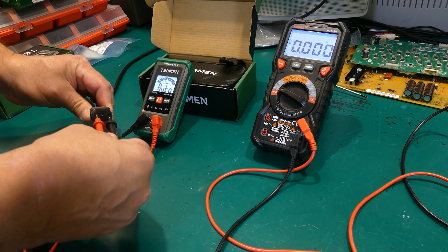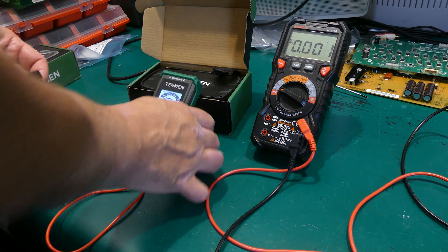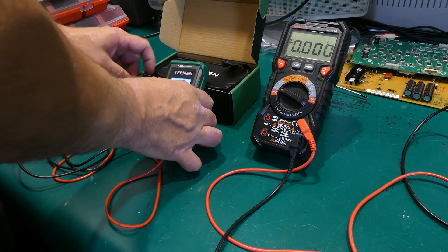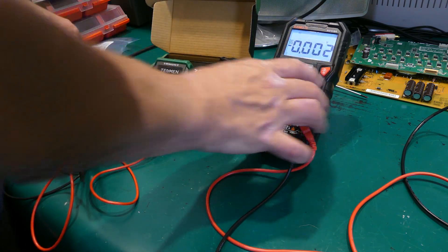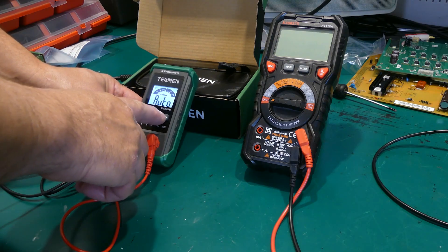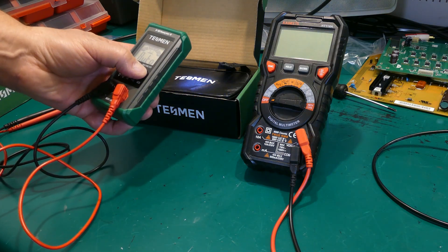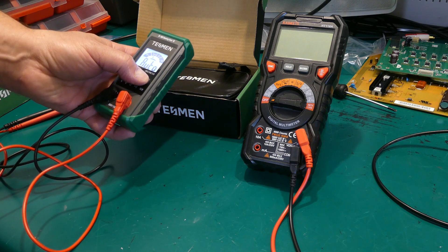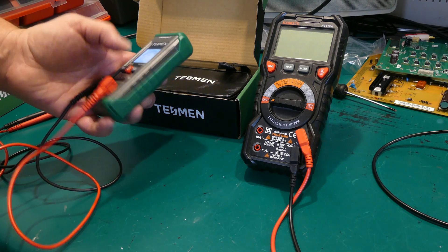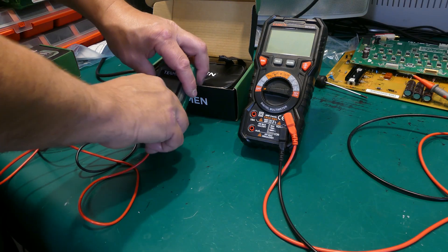The meter has a little backlight for the display that you can set on or off and it stays on — a great bonus when working in the dark, and even with big lights it displays clearly. It might even be a little brighter than my large meter. Turning the light on is easy: simply push the light button on or off. If you hold it for two seconds, it will turn on the LED at the back of the unit. You can light both at the same time by lighting the backlight first, then press and hold the light button again for two seconds. Reverse the procedure to turn them off, and holding the power button for two seconds will shut down the unit.